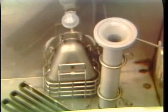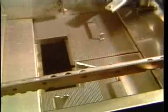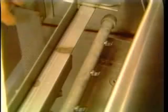First, the pump intake strainer and overflow tube must be in place. Then install the strainer pans. Next, install the strainer basket into the wash tank. Place the final rinse strainer over the drain in the final rinse pan.